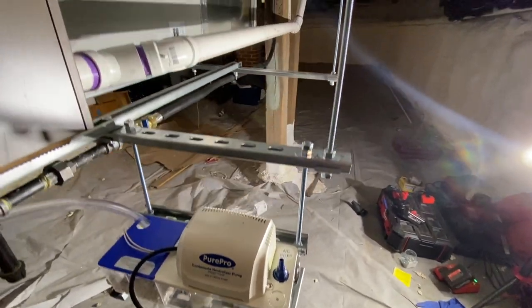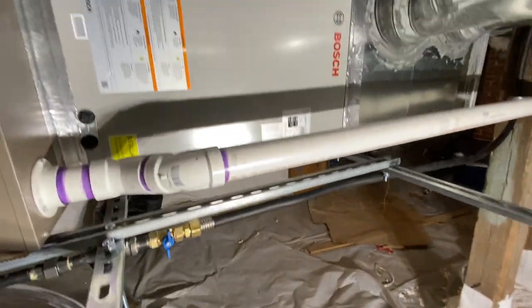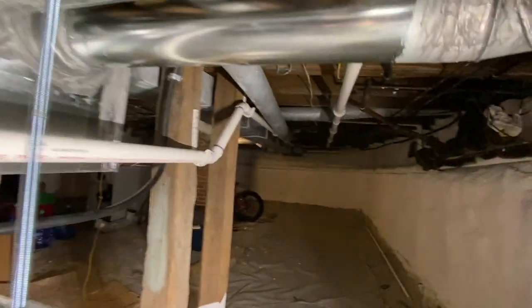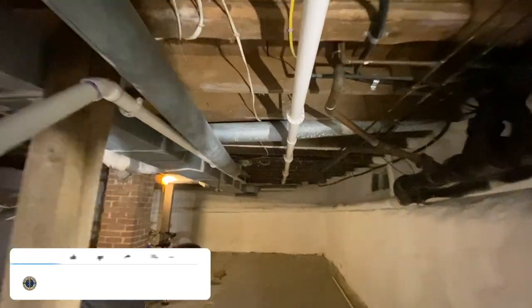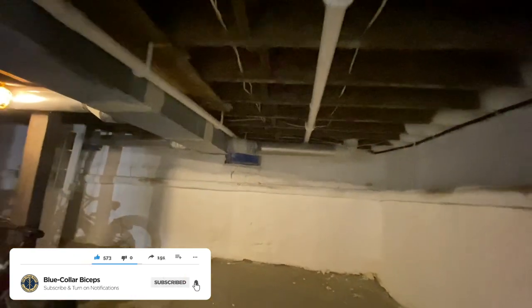This was one of our apprentices who did this drop bracket actually, and it came out awesome. Gas piping ties in underneath the unistrut, and also we ended up putting a hanger there, I think it's an end clip maybe, to support the gas CSST. See the gas line down there on the right, and venting and air intake come all the way over and sneak up and out right here with some 45s.